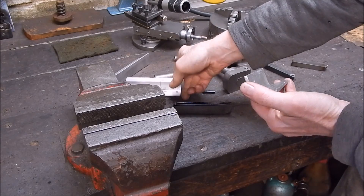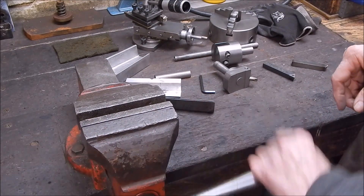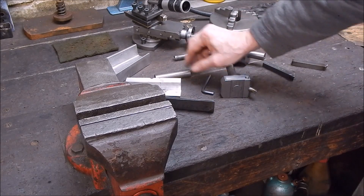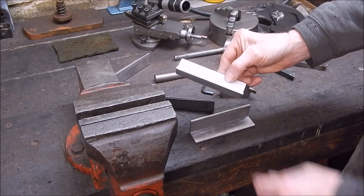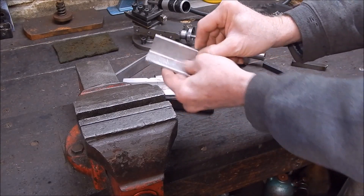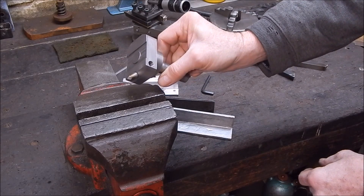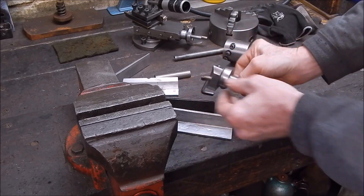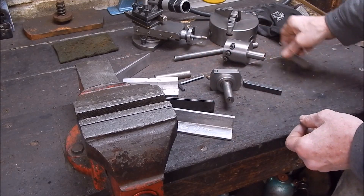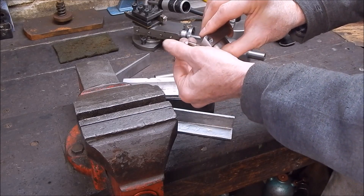Once again — free, do it yourself, you save all this money, it's great and it is good fun doing it. So what am I going to do today? Well, these fly cutters here — I thought I might just play around with them a bit more. I did a good job on this piece but on this other stuff I just whacked it through with the old single-point cutter. I'm going to try out a few different tips on the two fly cutters today: carbide round nose, high-speed steel, and a pointy-nose high-speed steel so I can get into corners with it.